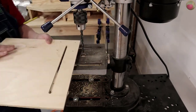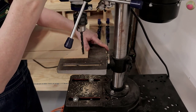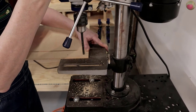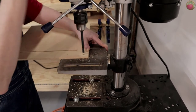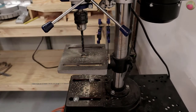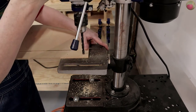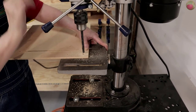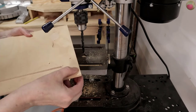Okay, for this next part, it's super important to be sure that you flip the jig board over to drill the countersinks on the back side. And it's super important for the screw heads to be below flush with the bottom of the jig. Now, if you're using 1/4 inch plywood for the jig, you really can't drill too far down before going all the way through. And you can use your router base to help determine the size of the countersink bit. Mine was 21/64 inches. Be sure the bit is wider than the head of the screw so that it can fit all the way in. Just go slow and check depth often. And when you resume going deeper, it will only throw out a little bit of dust at a time because you're not taking much off. So just keep going slow until you get it.